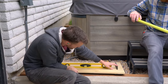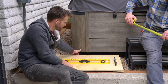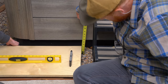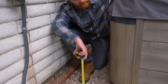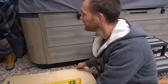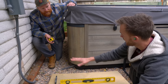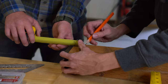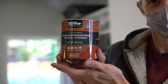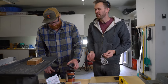With our feet on the bottom we can now take some measurements of what it takes to get this board nice and level. We're looking about two inches on the dot, three inches over here. So we've got a discrepancy in the gravel, so we can bring the gravel up and make it as level as possible. I put them both at two inches. We want to add a little more gravel to level it out. This is one of those steps that hopefully doesn't matter, but why not anyway.